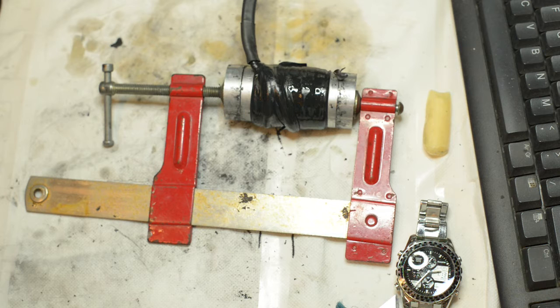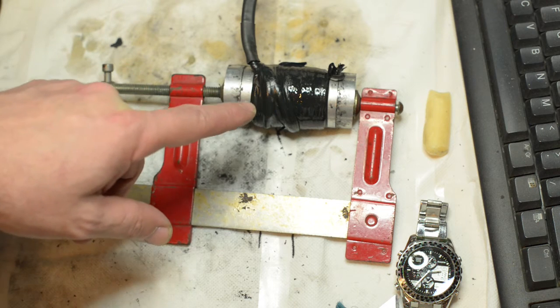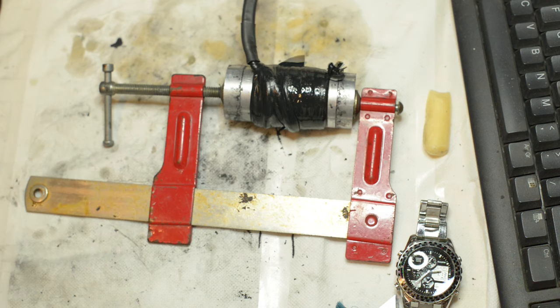However, due to a combination of temperature change and internal pressure buildup, alongside the fact that the viscosity is still changing even further, and thus the mixture becomes even thicker, that same mixture will eventually cease with its ability to escape through the gaps any further. Therefore, a form of internal balance has been reached, and curing progresses from that point onwards.